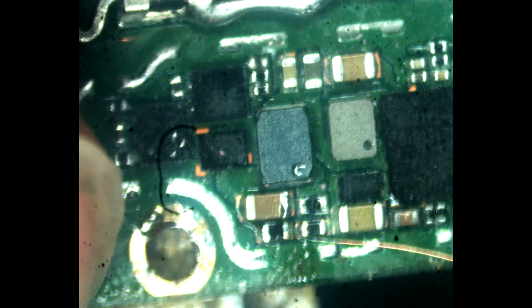At the beginning, of course, you have to dismantle the motherboard. The next step is to remove the metal shield. To do this, heat the place around as you can see in the video. I use a temperature around 300 Celsius.